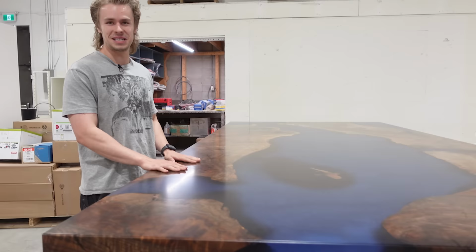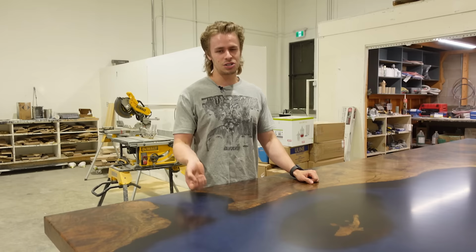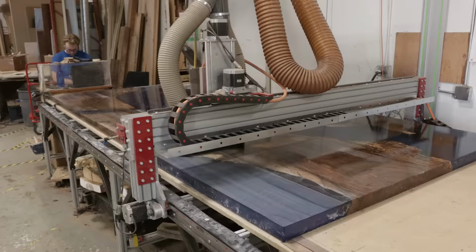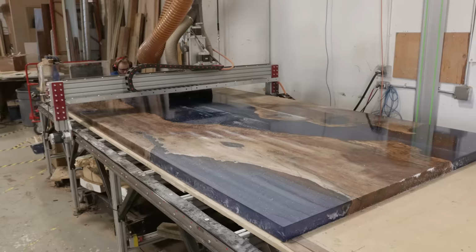I can't even help myself from doing it. That ended up in some small micro scratches and damage that we didn't want to send to Joe, so Gecko resprayed the table. Something that happens with polyurethane though, when you add too many coats, is it goes cloudy. So that's what we're dealing with here now. We've got a gorgeous finish that is going to protect perfectly, except it's too thick and it's coming out cloudy.